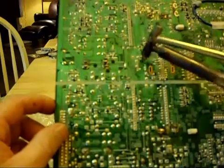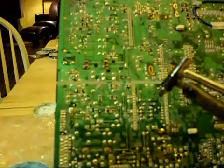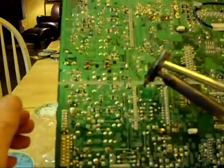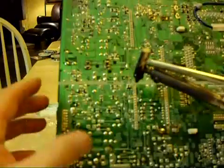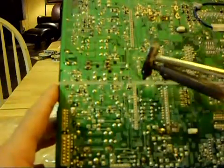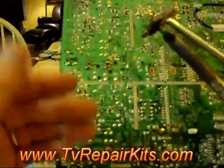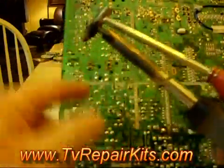One of the key points is if you go a little bit too fast the soldering iron itself will start to cool down. It's transferring too much heat, so it'll start to cool down and then it'll be less effective. So don't rush it — take your time. Let the soldering iron heat up between pins and just continue down de-soldering each one. And again, the most important thing is don't push the bulb while it's facing the board, because it will spray the solder that you've sucked up back onto the board itself.